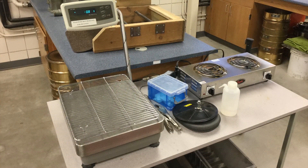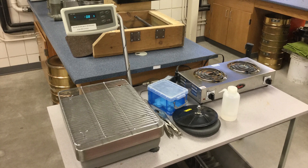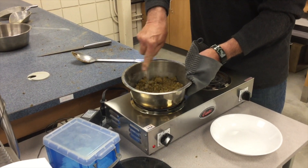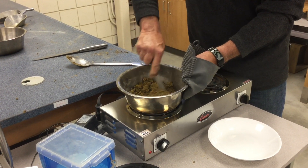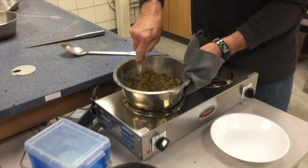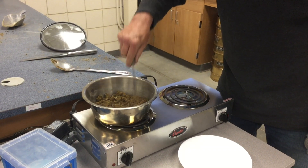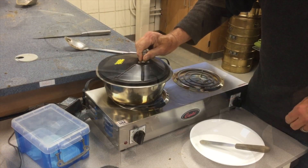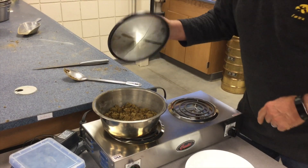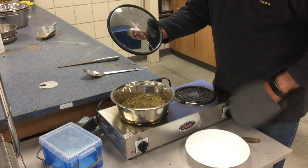The next step of drying will depend on the drying method. For direct heat, a hot plate or electric or gas stove or burner may be used. To prevent overheating and to obtain an even heat distribution through your sample, you should stir and break up the sample. Continue heating and stirring until the specimen appears dry. To help determine when the soil appears dry, place a mirror over the sample. If the mirror fogs up, the sample is still losing moisture. If the mirror does not fog up, remove the sample from the heat source.